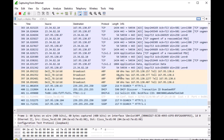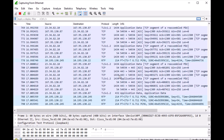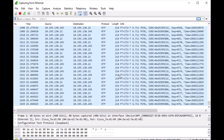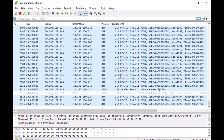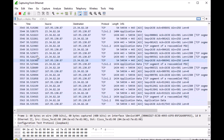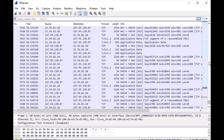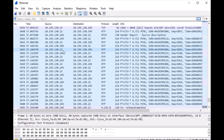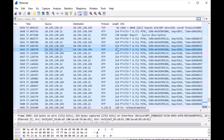I'm going to pull up Wireshark, start a new session, then call the phone and get a packet capture to show you how it works. Calling the digital phone with my cell phone — picking up: 'testing one two three four.' You'll see all my traffic going across — I'm at .22 and my SIP server is at .245. Looking at a typical audio packet: it's coming from my phone at dot-22, going to the SIP server at dot-245, using RTP protocol with the G.711 codec and mu-law flavor.